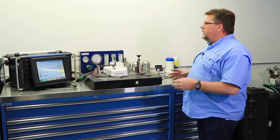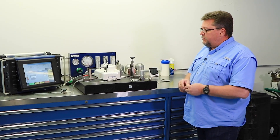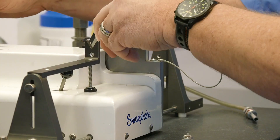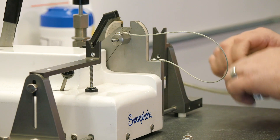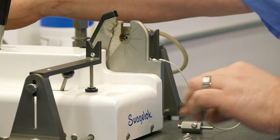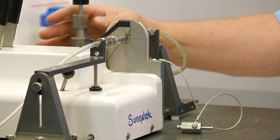What we're doing is joining fittings and tubing and valves together by means of welding. When you're talking orbital welding, it's a fully automatic process. It's up to you to input what size of material you're working with, and then it takes care of the speed of the rotor and the amperage being fed to the electrode. It's really very automatic and takes care of everything for you, as long as you input the correct information.